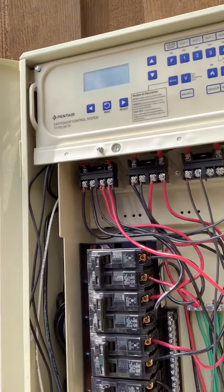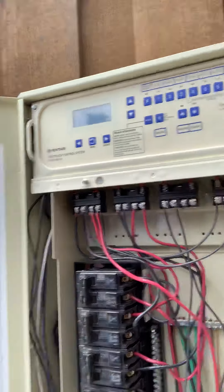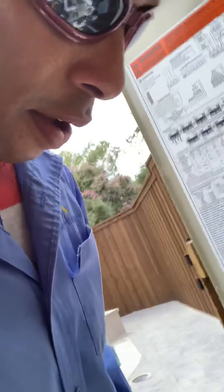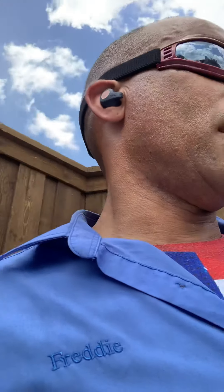What I do is land these on a little panel board in the back. If you look at my previous video, it'll show you all of that. But you want to make sure that your pool equipment is grounded — as you can see, you use number six wire for this type and size of equipment. Always look in the code book to find out what equipment you need. That should cover that. And then you can have a beautiful pool like this — I mean, you've got to work for a pool like this.